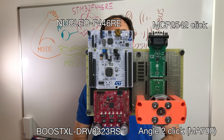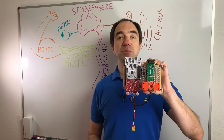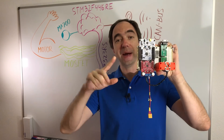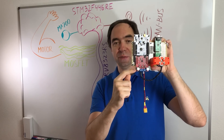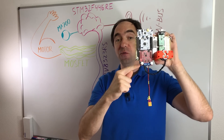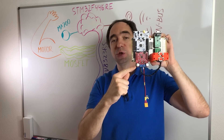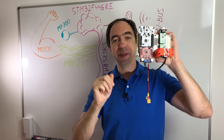These are the names of the development boards for your reference. In terms of electronics, the only difference between this prototype and the real MIT Mini Cheetah controller is in the MOSFETs. On these development boards the MOSFETs are not very powerful, so we cannot drive a big and powerful motor with them. But for a small motor and for our test it's good enough. The sensing resistors are also different, but this is a minor detail.